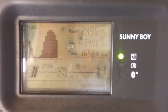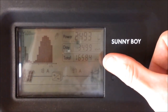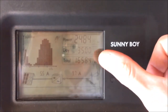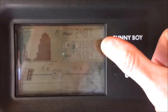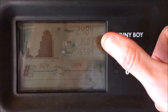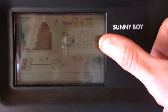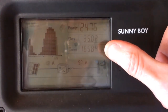The most important thing when reading any inverter is your daily production and your kilowatt hours for all time. Any system sold to you by a reputable company will come with a design statement showing what the inverter will do in terms of daily production month by month and an average for the year. The easiest way to check if your inverter is working properly is to check this daily production. You can also check it over all time by taking this figure and dividing it by the number of days installed — that should roughly match your average production figure on your design estimate.